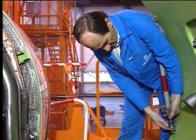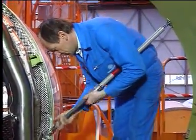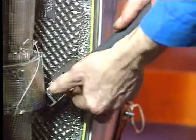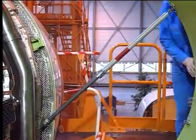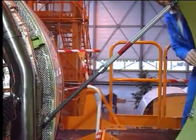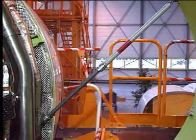Deploy the hold open rods and engage them on their attach brackets on the fan case. Finally, remove the sling and return to the initial aircraft configuration as defined in the close-up subtasks.